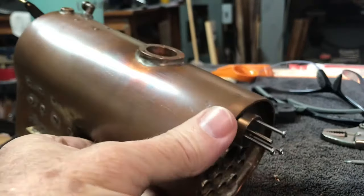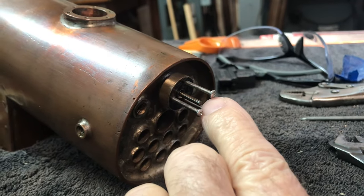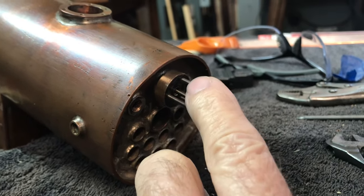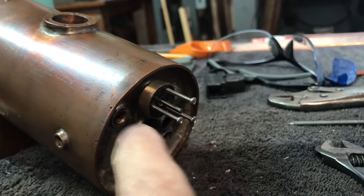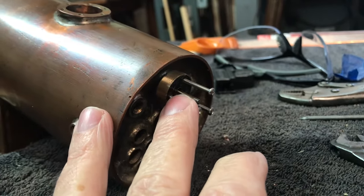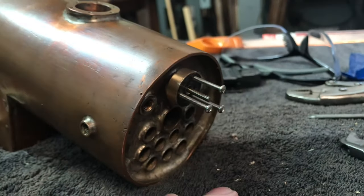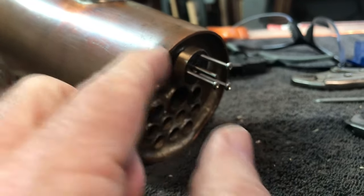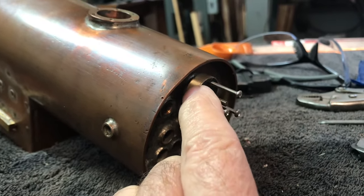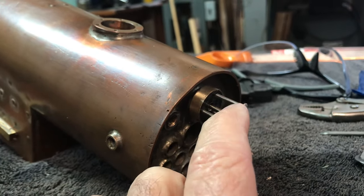I used LBSC's suggestion — a small drill bit that fits inside the copper tube — to direct the copper tube in line with the header. I've got it almost all the way on; it needs to go about one more revolution. It works out great because the bushing is threaded 40 threads per inch — 5/16-40 on the outside threading into 3/16-40 on the inside — so the revolutions match with no interference. The problem is I've run out of the threaded portion on the end of that copper tube, so I need to take it apart and thread the front end about an eighth inch more of the 40 threads per inch to pull this thing all the way together.